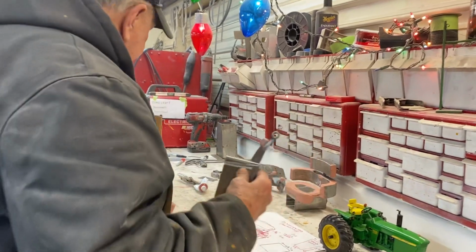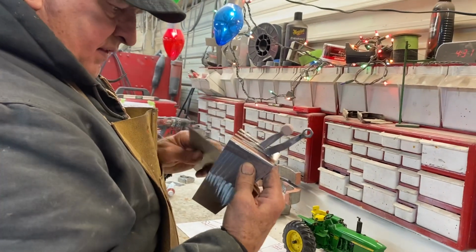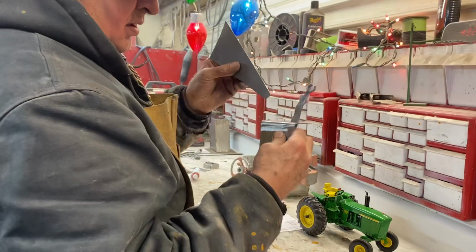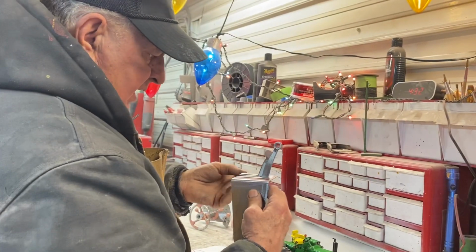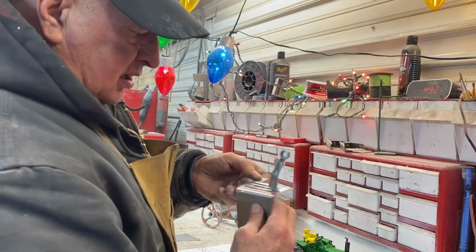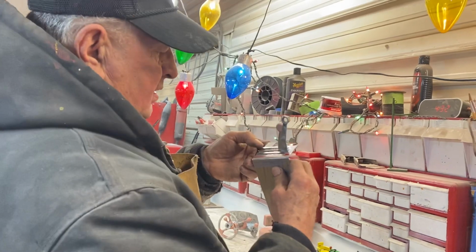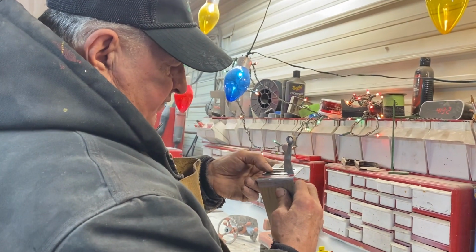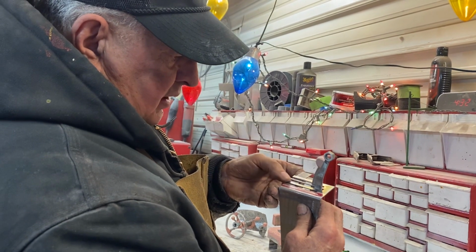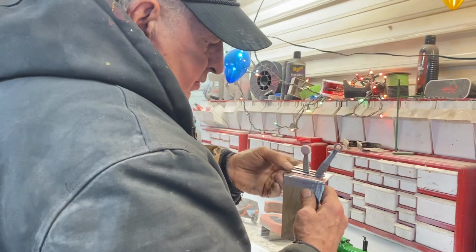And then I'll build, once those are on there and I get the pins attached here where they're going to be, once these levers are attached, then I'll go back and I'll put a piece of metal in here underneath and weld it underneath, and then I'll get some filler and I'll fill that in, so you won't even know that was cut open like that. And then when that lever comes back, they'll hit that, plus that'll reinforce it.